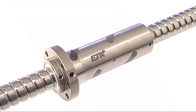Compared to other alternatives, a ball screw's low friction generates high mechanical efficiency. Unlike comparable Acme lead screws, which are only 50% efficient, a typical ball screw offers 90% efficiency. The higher cost of ball screws can be offset by decreased power requirements for similar net performance.